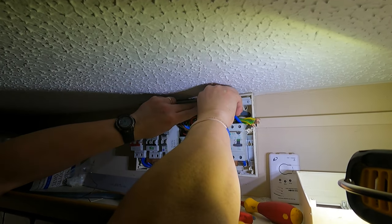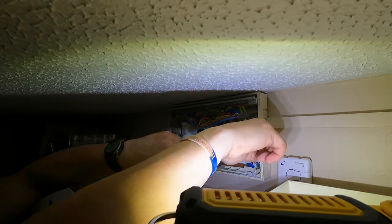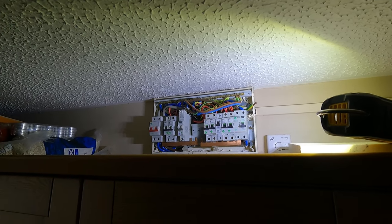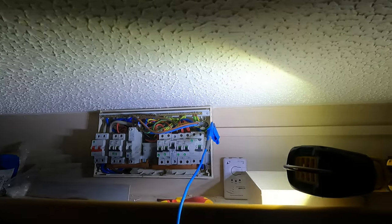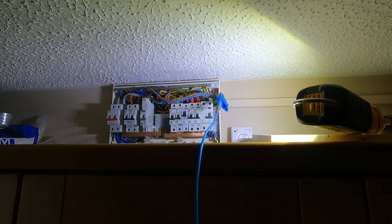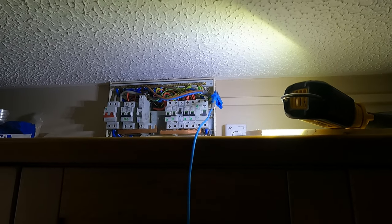What a mess of conductors in here, it really is. These are bonding conductors. Make sure these are back in. And then the main earthing conductor. What I'm going to do first is carry out another test, which is called the Ze. And what this does is it measures to make sure that the main earth going out is a good earth. So if there is a fault, any fault currents will go straight to earth without any problems. But you learn all this.